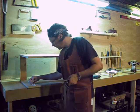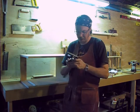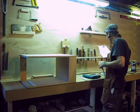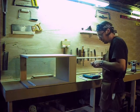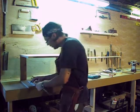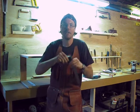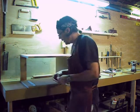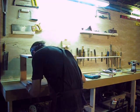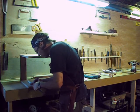Okay? So, from what I can make of the instructions, it should be 5/64 in. About like that. Use your combo square, set it to the right depth, and then use it for all 4 drawer guides. And then they're supposed to go about 1/4 inch above that stop line, which would be 1/4 inch above the opening.